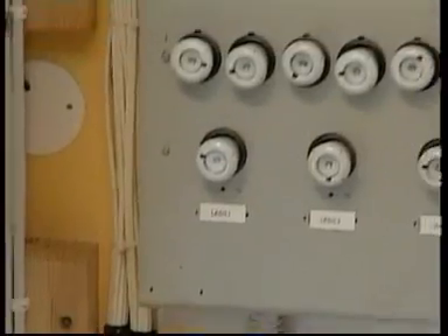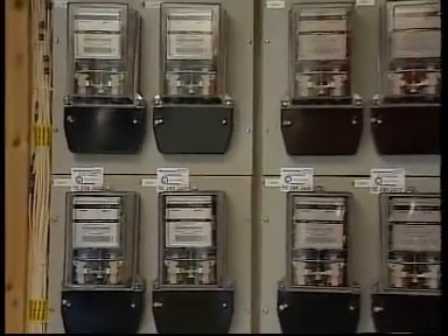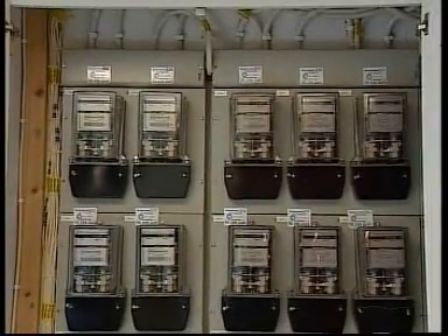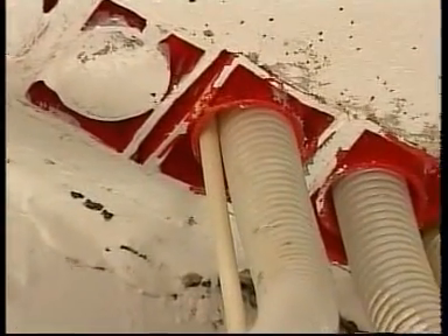The optical fibers can also be drawn in with the TV antenna cables or via the ventilation system, lift or elevator shaft, or the garbage chute. In this case, use has been made of the tiny space alongside the thicker electricity cables.